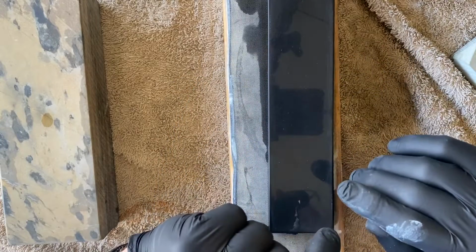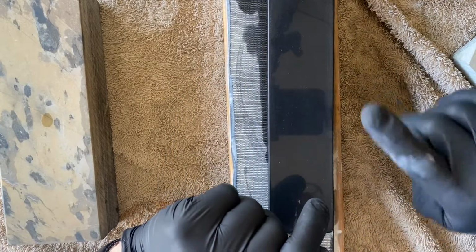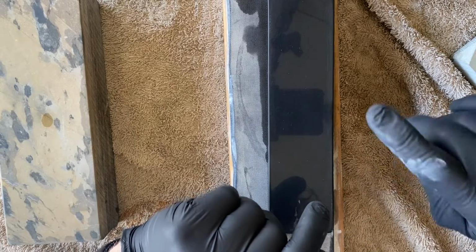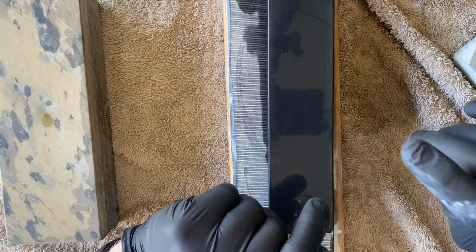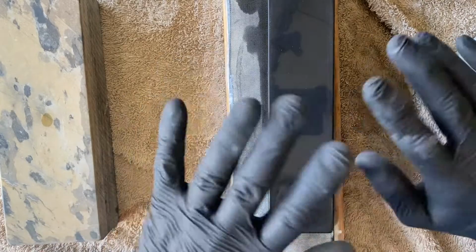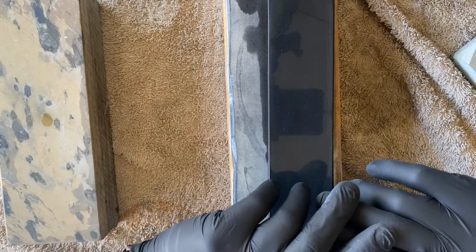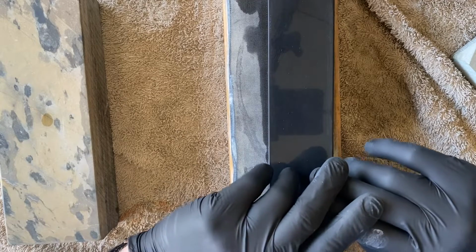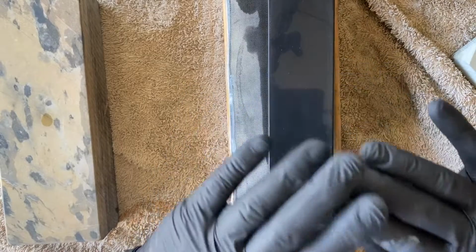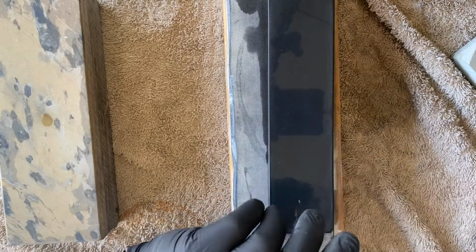To hone a razor is 90% bevel set, 5% mid-range and polishing, and 5% tactile feel to get to incredible edges. Those are the numbers. The bulk of the work is laying the foundation.